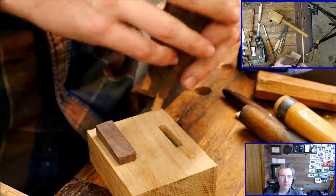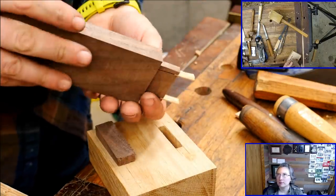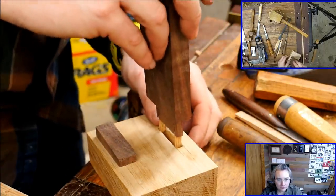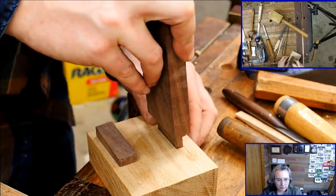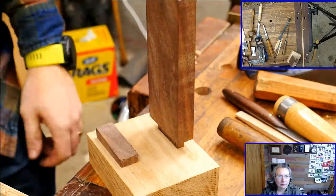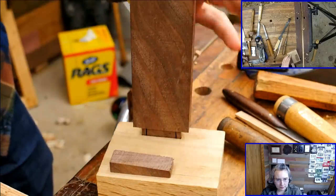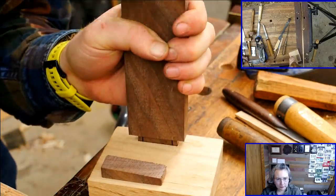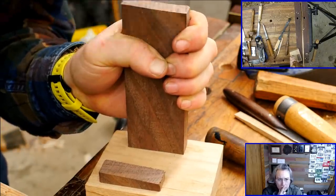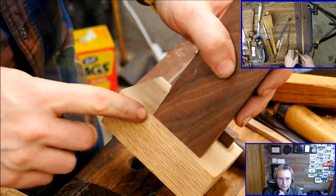Now we can put these in here. Slide everything into place carefully — you can see how they're in a little ways. I want to put those in there until they touch the bottom of the mortise, then very carefully start tapping it down in. From this point on it's locked — I can't get that out of there. This is now an integral piece, this is not something you can come back from. So you want to make sure everything is good before you get there. When you drive it down nice and tight, you have a really tight, clean line all the way across.